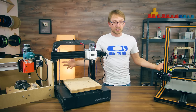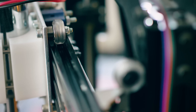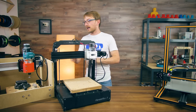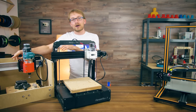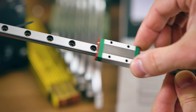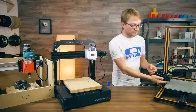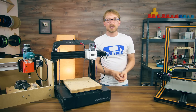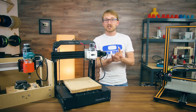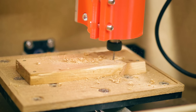First difference: the frame. Both 3D printer machines are using machine profiles — specifically the open-build style V-slot, which is already a good bit sturdier than your typical 8mm smooth unsupported round bars. Bob has these massive aluminum angle profiles with wheels running on the edges. Proper milling machines would either have linear carriages or sliding dovetails. Why? Because rigidity. On a 3D printer, there are no forces between your toolhead and your workpiece, because the hotend is basically just skimming over the parts and lays down molten plastic as it goes. On a milling machine, you have the cutting edges of your tool actually digging into the material, and that does generate quite a significant amount of force.